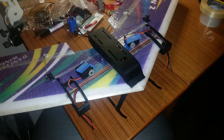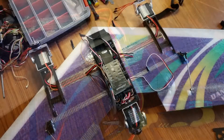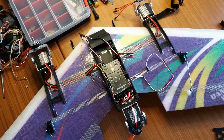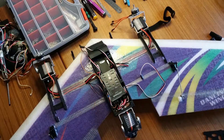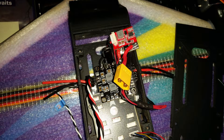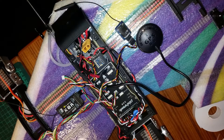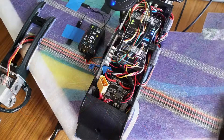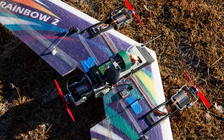You can also see that the entire airframe has been laminated. Here's an image of the forward servo, and starting to dry-fit the components. The ESCs and power distribution board came from an old mini quad — the EMAX Lightning 30A ESCs. This is just images of the dry-fitting of the various components: the distro board, the airspeed sensor and the current sensor were pushed up into the nose. You can also see the layout of the other components — the Pixhawk. I did use a different receiver for the actual flight, an FrSky XM Plus.